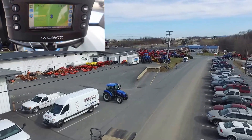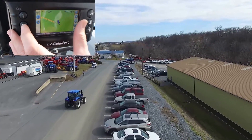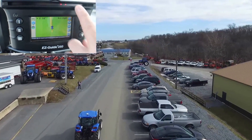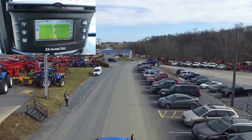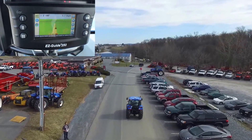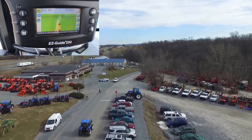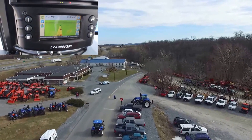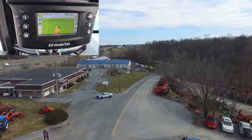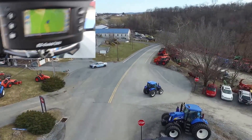All the guidance lines are down to the left of our line. We're going to pull over to the other side of our original guidance line, turn our paint on. Now you can actually see the LEDs up here at the top. I'm a little bit too far — I need to get over to the right a little bit. There's our green LED saying we're in the middle of our pass. We're painting the screen. It says 1L because we are one pass to the left of our original pass. As we work farther to the right or left, it will tell us where we're at relative to the line.